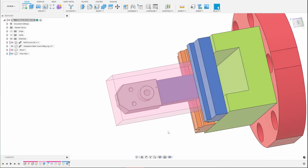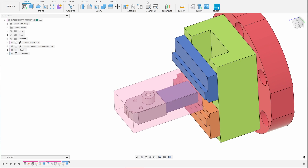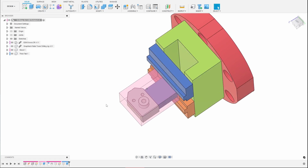The part that I made and gave to Matt had a flaw. I decided to hand tap it just because I didn't feel like putting the tap into the machine, and as a result I didn't get the tapping very straight. When he tightened it down, the jig was actually at an angle — it wasn't completely flat. I had been thinking about changing the strategy anyway to rotate the part 90 degrees, so I decided to remake it and this time to do rigid tapping to ensure that the hole was tapped perfectly perpendicular to the part. As a reminder, this is how I had it set up for the first operation. One of the things I realized is this was inefficient use of the material — if I rotated it 90 degrees it would be a better use of the material, so that's what I did, and it fits just fine.